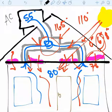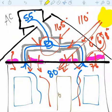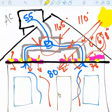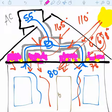But the convective heat is where you've just got leaks in your thermal envelope. So ideally, your attic floor should just be one solid surface. There should be no penetrations. They should all be sealed up with foam or other air-resistant materials. So that's how we go in and address all these things. We seal them up tight so that you have this constant thermal envelope. And then obviously once you've got your envelope sealed, then you can add your insulation and get that up to the